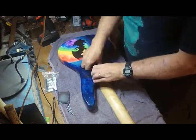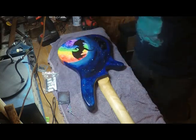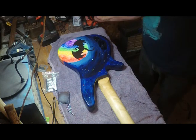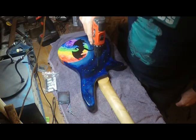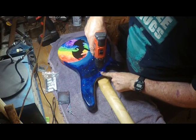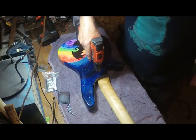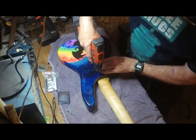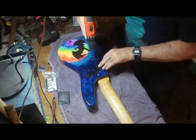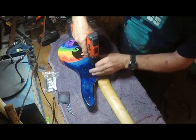The holes in the body are already there, but we need to drill some pilot holes for the neck. What I've done is pick a drill bit that is exactly the same size as the holes, so that the holes in the body serve as pilot holes or guide holes while I drill some pilots for the screws that go into the neck. I discovered that two of these holes actually got lacquered over by the spray.